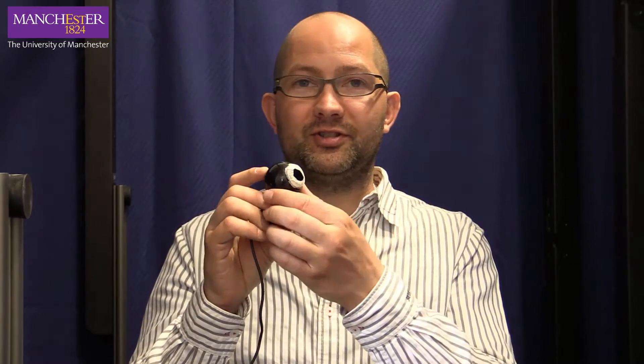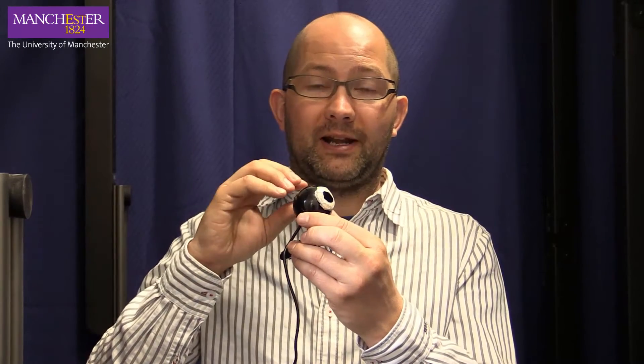To create this we used a very simple camera and just followed instructions online. We scraped off the filter that removes the IR light from it, so it only sees infrared rather than what you and I normally see. Then we used just two strips of completely black film negative on the front of it. So now this camera sees infrared light — if you shine a remote control at it, you'd see the light from that, which you normally don't pick up visually.